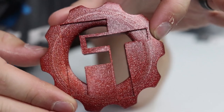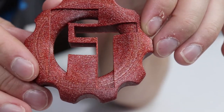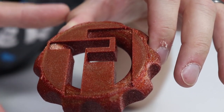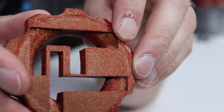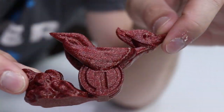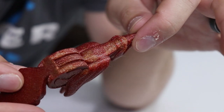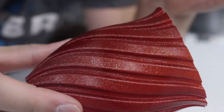Now the Glint Red. As you can see it has that reddish, kind of rust color — reddish brown — it has the glitter which really makes it sparkle. This might work for some people and might not for others, but it is again very shiny and very consistent throughout the print. This did way better over the supports than the White Aluminum did — way better. It actually would trump some of the Proto-Pasta samples I printed previously. This was 210°C as well. The Filament Runner came out with just a couple little strings here and there, but underneath, looking at the overhangs, way better than the White Aluminum and miles better than what came out last month.